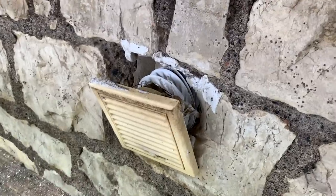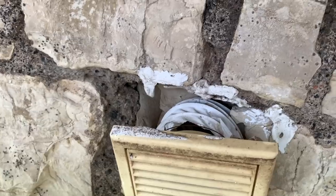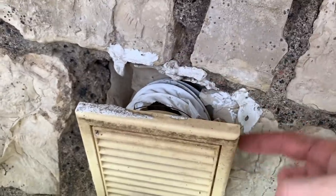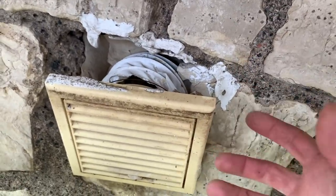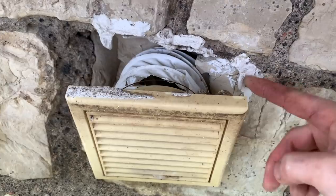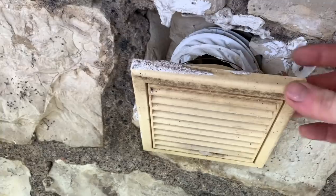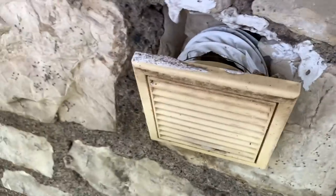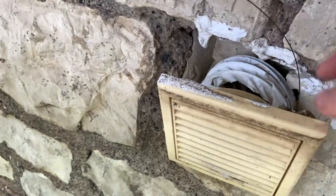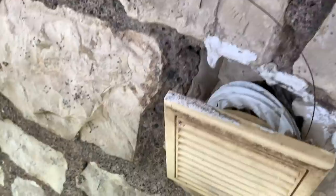This is what happens when you don't do it properly. The electricians, years ago when we moved in, drilled this purely from the inside with no access outside — or at least they didn't to start with — drilled through and blew out the whole of this stone and that stone. Some of it fell down and smashed the glass roof of the porch. They didn't put any fixings in, so all it is is just some sort of construction adhesive, and obviously that's failed and it's created like this perfect roost for jackdaws. In five years all of this has happened, which is why rigid ducting is always a bit better. But if you do have to use flexible, this isn't the way to do it.